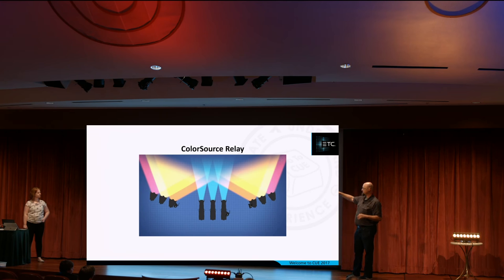In this particular instance, if these are all high in the air, you may want to have your transmitter below, angling up. The way these antennas are, their donuts are going to be vertical. So if you have your signal donut from your transmitter spreading out mostly horizontally, that's going to cross all three of those. Learning to think in three dimensions when we think about our wireless signal is a skill we're going to have to build. It's really about figuring out how to get the donuts to bump into each other so that our signals are matching up.